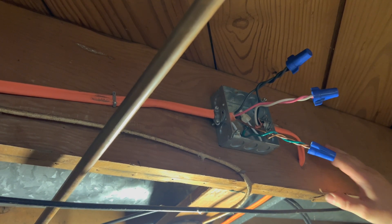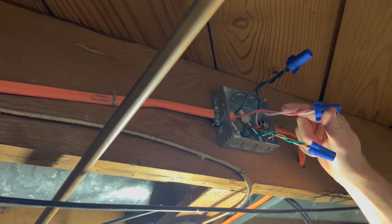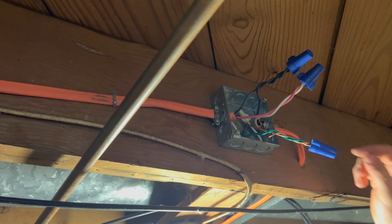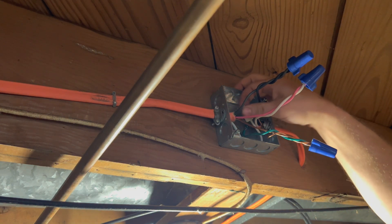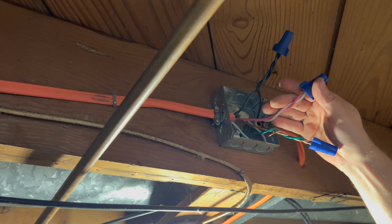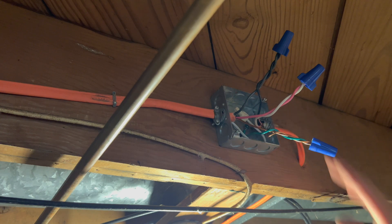I just wanted to point out before I close up this box: yes, I'm going to have a white wire tied to the red wire. That's because with 220, white is actually not neutral — it is going to be a hot wire. Over in the breaker panel, this will be connected to the breaker. We've got the other white wire on the 10-3 capped off in the back. So black to black, white to red, and then the bare wire along with the grounding screw to the box. We'll put a cover on this and move on to the breaker panel.